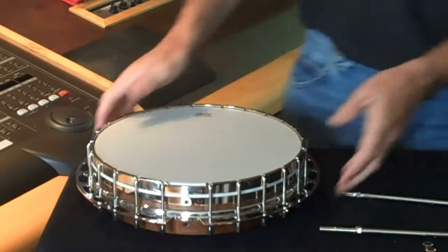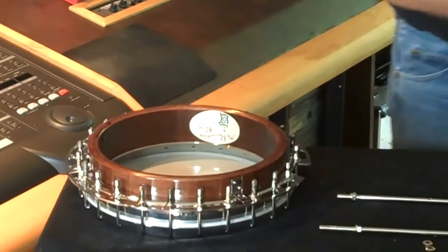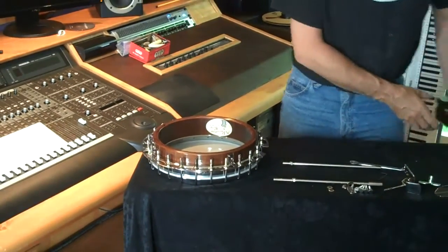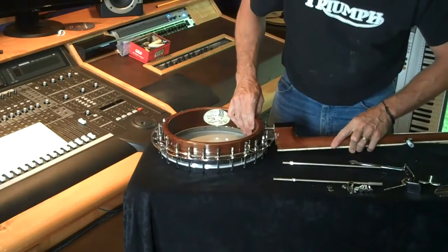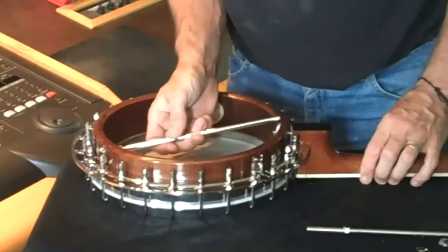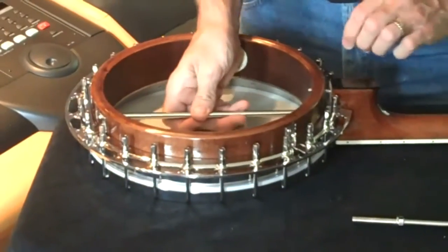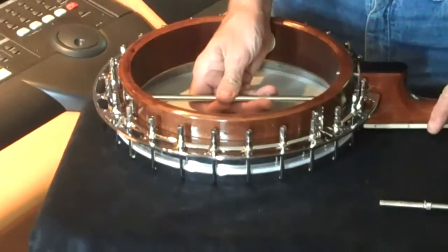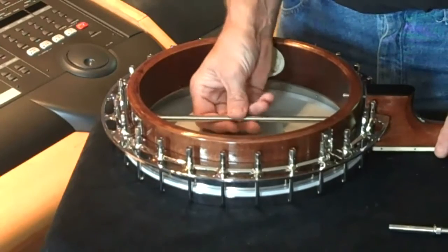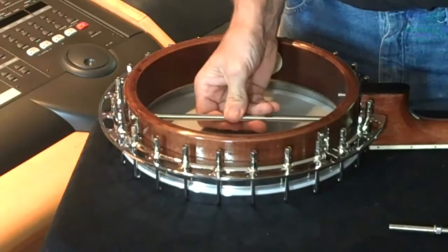Okay, now reinstall the neck. Let me get rid of this paper and chiseling stuff. I'm just going to slide the neck into the holes that are there, just so the bolts are sticking through. Put the bottom end in first into the hole. If you can get that there, just start the screw just onto the neck — just assist the neck a little bit so it's finger tight and firm.